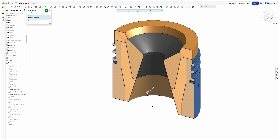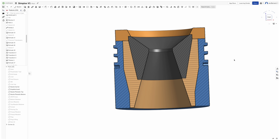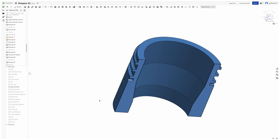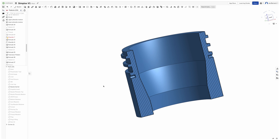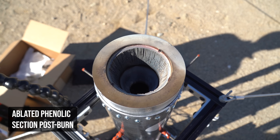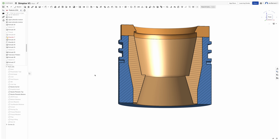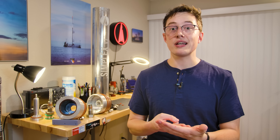Now, using Onshape and looking at a cross section, I designed this nozzle out of three separate materials: the aluminum nozzle carrier, the phenolic nozzle insulator, and the graphite throat. The aluminum carrier provides a strong mechanical way to hold the nozzle inside of the case with those radial bolts, and it provides a smooth, non-porous surface for the O-rings to seal against. The phenolic insulator ablates away, protecting the aluminum from the hot gas and from the heat of the graphite throat, which does not ablate away, does not melt, but is really, really hot.